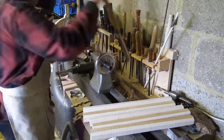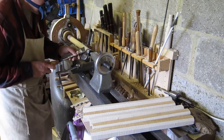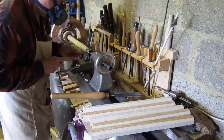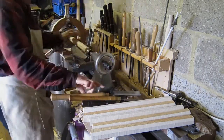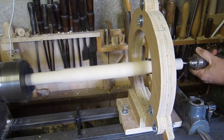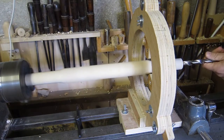Here you can see there are six, and I can put them on the lathe, turn the ends round, and square up the ends of the pieces with a skew chisel. I do this to both ends. Then I can mount it in a chuck at one end and a homemade steady on the other, and drill pilot holes for the bore.